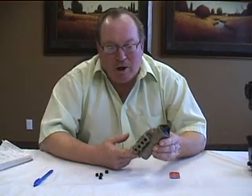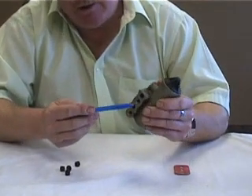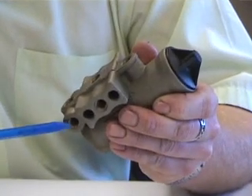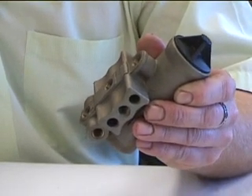There are a few basic things that you need to watch for. Number one, the center section of the governor — these three ports, one, two, and three — are the unloader section. The bottom section, one, two, and three, are the reservoir section from the wet tank.